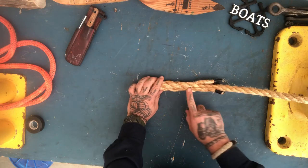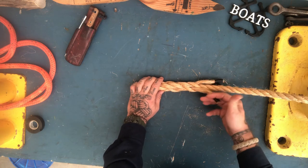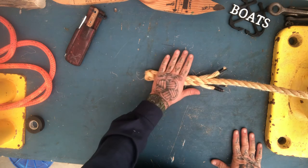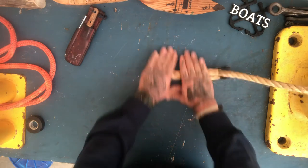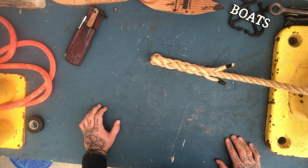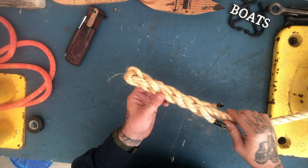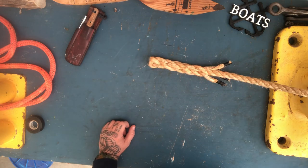That's a nice back splice — it could provide a handhold, you could taper the ends. I'm not a big fan of leaving plastic electrical tape on there because it can cause rot by trapping moisture. It's a real simple way to put an ending, a handle, or just increase the size of your line at the end. Thanks guys — next video will be the eye splice.